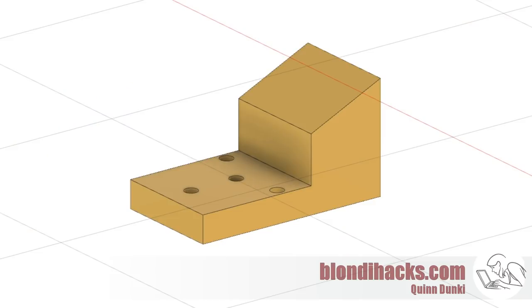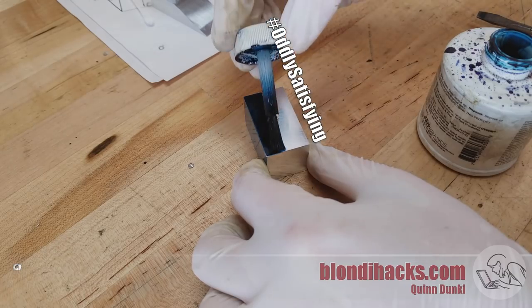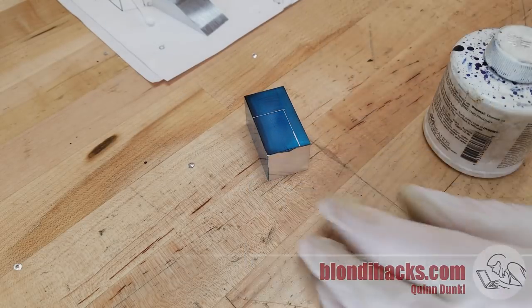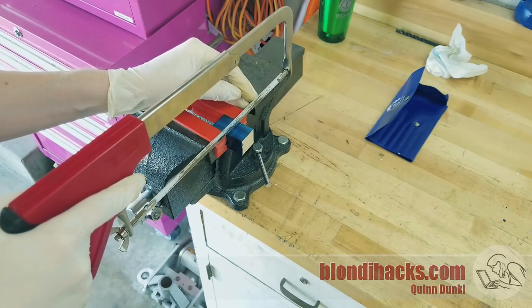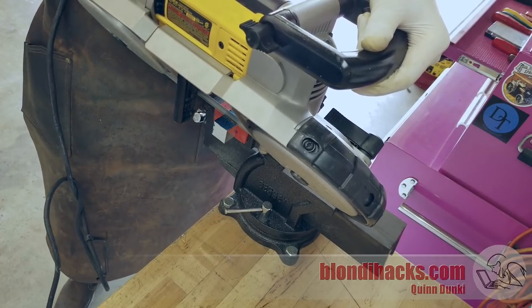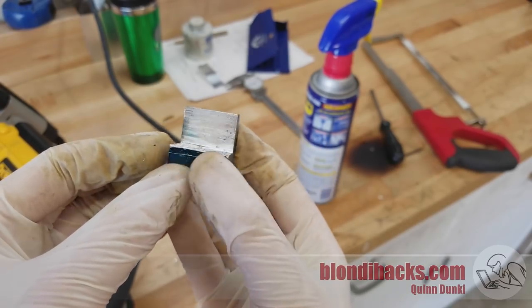Now that our stock is at our outer dimensions, the first feature we're going to make is this big recess. I'm going to lay this out old school — I could just do this with the DRO, but we have an interesting challenge I want to illuminate. There's the top side and now we'll mark the side as well so you can see in three dimensions what we're trying to create. That's the negative space we want to remove, and the problem is that's a lot of chips to make. As I always say, the fastest machine tool is the saw, so we're going to cut that chunk out in an approximate fashion. I'll start with a hand hacksaw to create a groove that helps the porta-band start much better and makes it easier to get a straight cut. We make the cut from both sides, being very careful not to touch the lines, and then finish up with the hand hacksaw again.